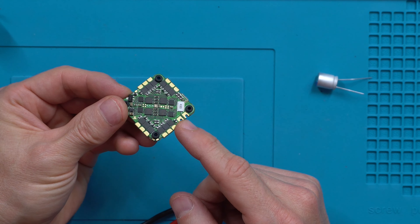I'm going to give it about two inches of extra space — there's nowhere to go inside here and it won't reach all the way to the back, so that's more than enough to get around things without too much excess. Since R is at the top, the T from the receiver goes there. White wire is T, so it's going to be white, yellow, black, and red. Using the LED on my magnifying glasses to see better. RX from the receiver goes to TX on the controller. Air unit is wired up — red to red, black to black, white wire to RX, gray wire to TX — and correspondingly they flip as they go into the controller.